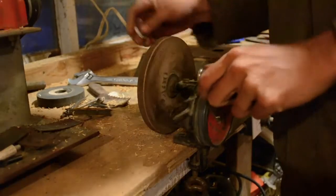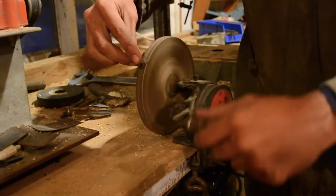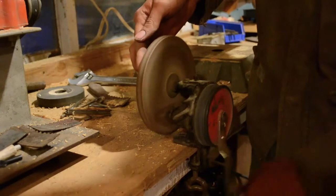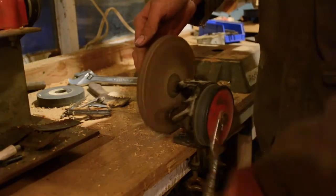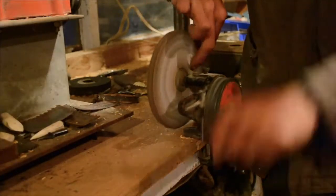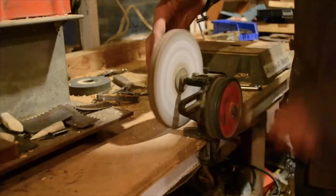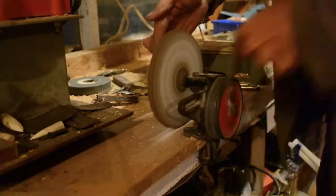For the next step I'm going to move things into my workshop. To grind the shell I am using a hand crank grinder. The wheel is of a very fine grit. Both of these help me to minimize vibrations. Electric grinders tend to bounce all over the place — this one just rocks back and forth. Using the round of the grinder is faster but also more dangerous; I don't want to risk it while I'm on camera so I switch to the flat. What I'm doing here is just grinding the inside of the shell flat and smooth. You want a nice broad flat section for a button.